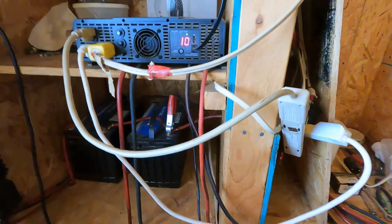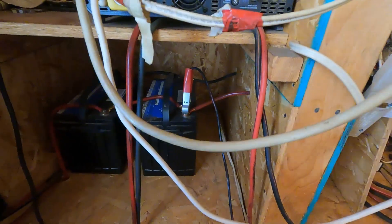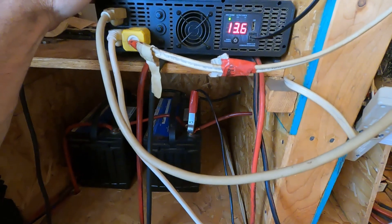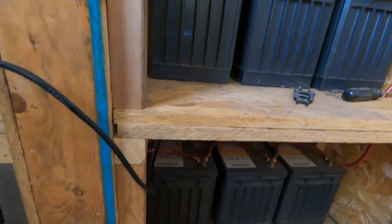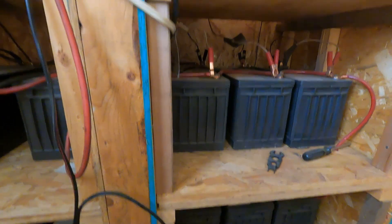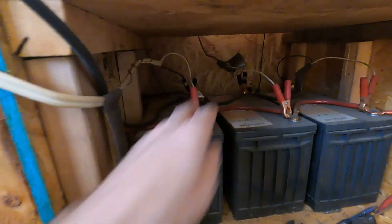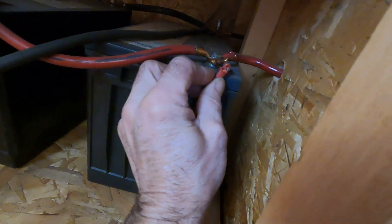The inverter has two positive leads and two negative leads that tie into the back. This one is tied into one set of batteries, and the other is tied into a different set of batteries, so I'm pulling off two different sets and running grounds to one end. It's a very good setup and works well for me. Just making sure your positives are tied together and your negatives are tied together, then tie them into your charge controller and run from the batteries to the inverter.